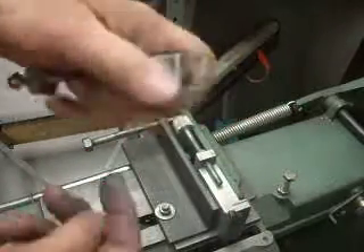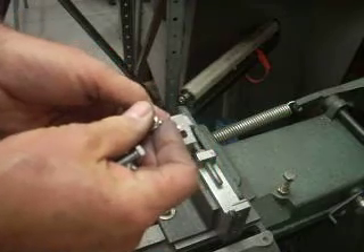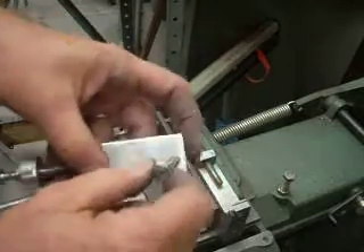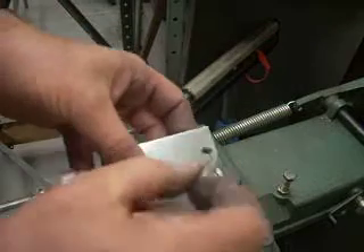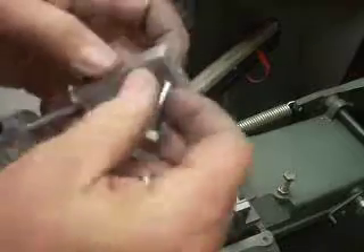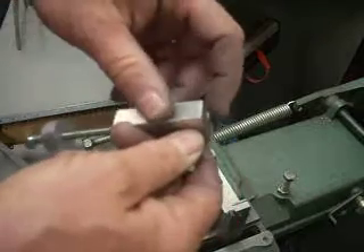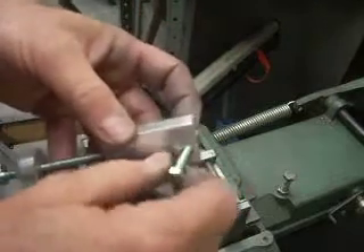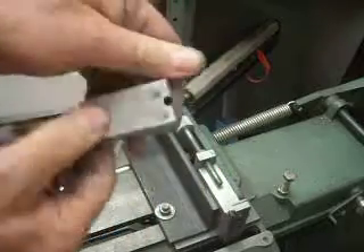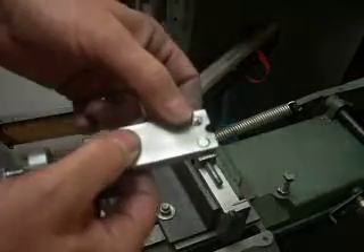This is a little more complicated than the one shown in the plans. The one in the plans has a hole that's simply 45 degrees back like this. I made it a compound angle of 45 and 45, but I don't think that's necessary. Very simply, the bolt drops in the hole, you give it a twist — 180 degrees — take it out, you're done. Because of this angle, the body of the bolt, the perimeter of the bolt around the corner, is exposed about 50 thousandths of an inch. So all you do is push this into a belt sander and it takes off just the thread. There are two neodymium magnets bedded into holes drilled by a 6.5mm end mill — you could also drill with just an F-drill. Put them in the holes and peen it just to hold them in. There's a stop on this side that catches the table, but when using it you really want to press down on this block because it can slide.